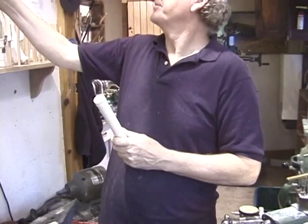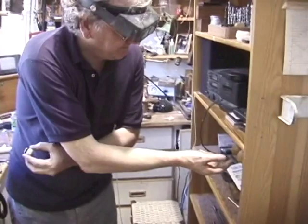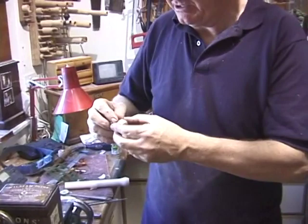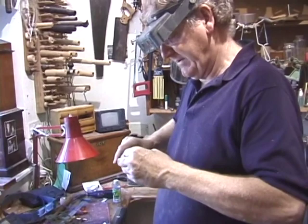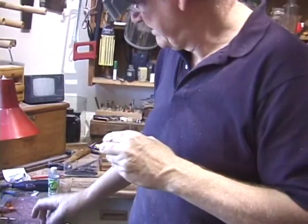All the pieces fitting together in the flute have got to be loose, and the tightness is set by wrapping with silk, because as the flute expands and contracts, we don't want the socket and tenon to get overstressed, causing a crack in the socket. So there's always this intermediate winding of thread that takes up the gap, and we use that so that the player can adjust the tightness or looseness of the joints. But we don't want the wood or ivory pieces to be touching, as that would cause high stress.